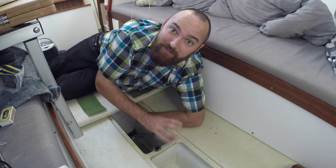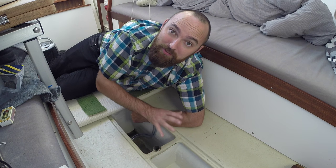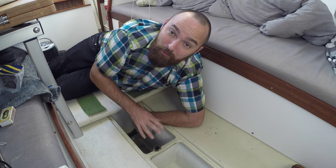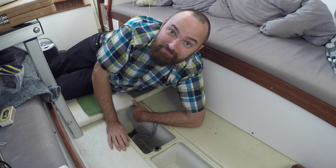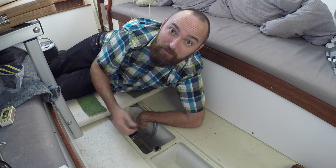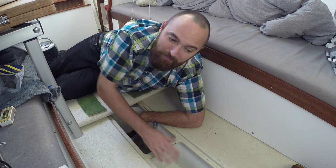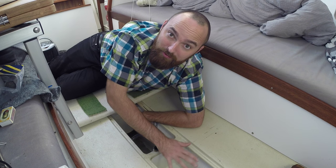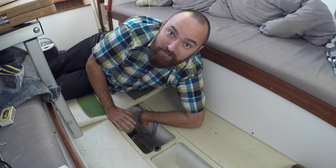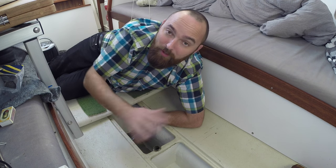There were a few questions as to why I want to separate my bilge into two parts. The first two weeks I was living aboard, it was raining quite a lot and I got somewhere between 7 and 10 liters of water in the bilge — all fresh water. That water mixed with the oil dripping from my gearbox and created quite a mess. Discarding all of that water was a pain because I didn't just want to pump it overboard in the marina with oil in there. By separating the two parts, I now have the fresh water portion pumped overboard automatically, and the few drops of salt water and little bit of oil will end up in this portion without a ton of water, so it'll be easy for me to just wipe that away.